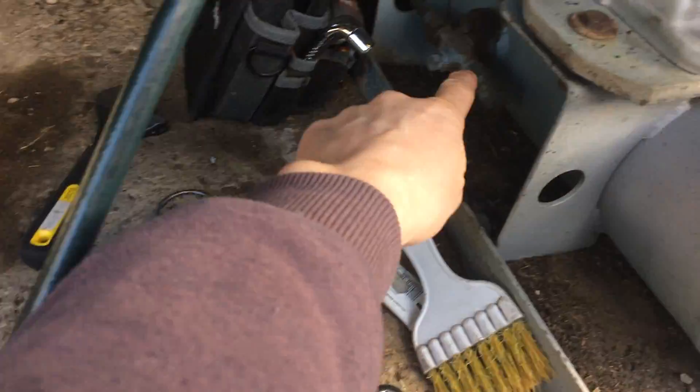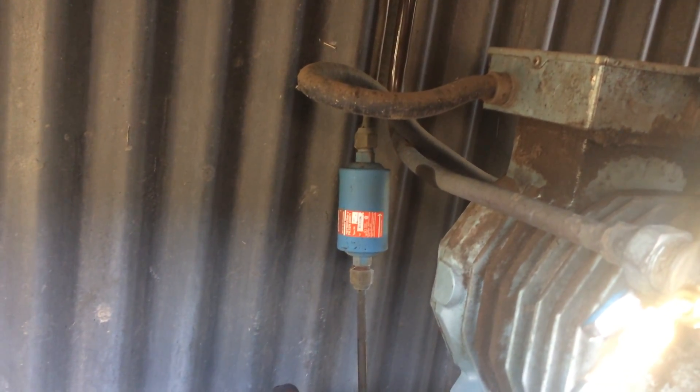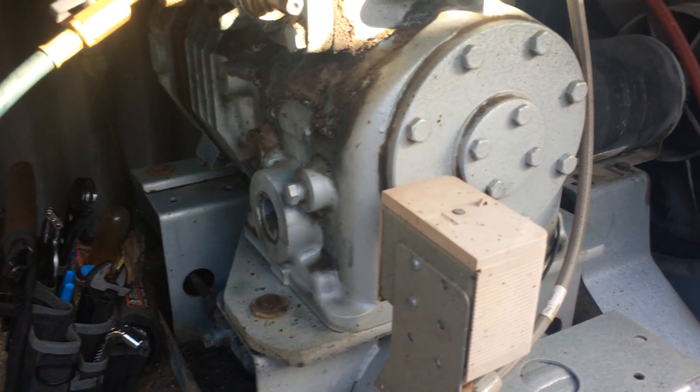We've got that pump down. We've shut the receiver valve. We'll go and put a new filter in there, new sight glass, and have a look in the valves to see what's going on. If you just check the orifice out of that one — there's a little bit of water on it, some under the brass. And there's also a couple of drips on the end of the valve. It's difficult to tell because I did warm it up and dry it with the burner, but I think those have come from inside. This does look like it's got water in there from somewhere.